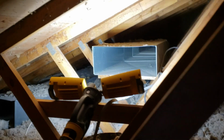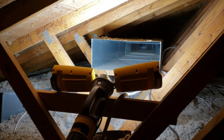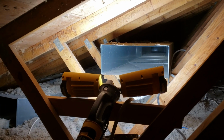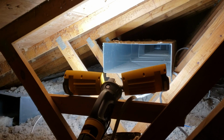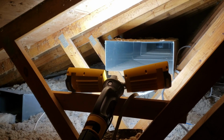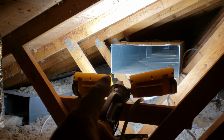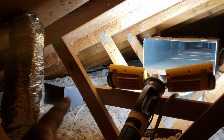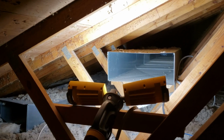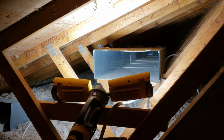And all of this ductwork is completely uninsulated, not insulated at all the way through the attic. So this attic space is generally the same temperature as outside. I mean, maybe a few degrees warmer, maybe 5-10 degrees warmer. So if it's 10 degrees outside, it's 20 up here. And so it was trying to blow all the hot air through a 20-degree attic, and then sucking all the return air, trying to heat 20-degree air. And obviously that just didn't work very well.